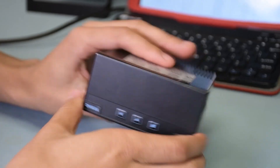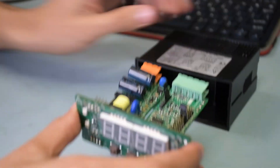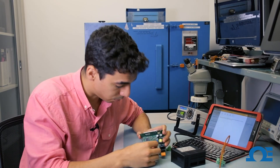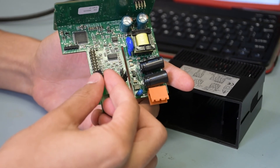First thing you're going to want to do is open it up and make sure it's properly configured to take in thermocouple input. Pop the face out, open it up, and you're going to see something like this. According to the manual, you're going to want to make sure that one of the jumpers is connected to pins four and five, and on this side you want it running across pin E.